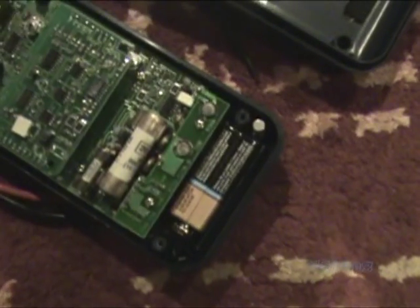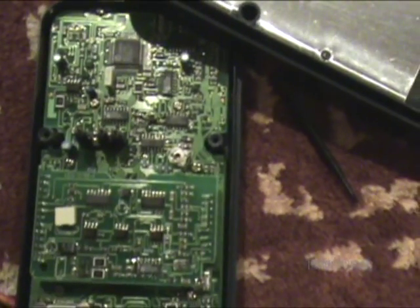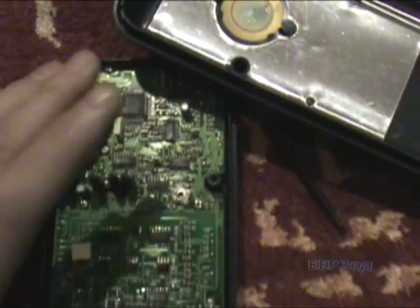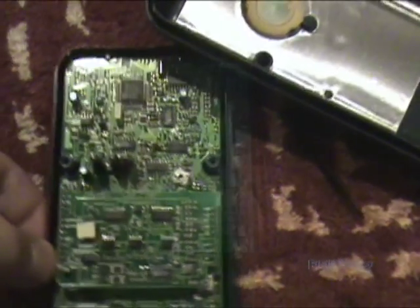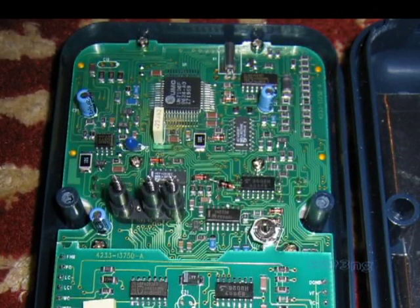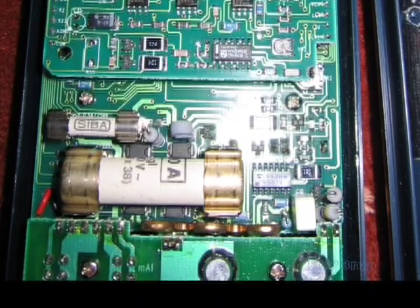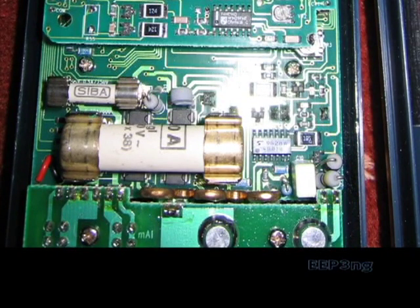You'll see that they've used three springs sticking out of the PC board — that's actually kind of a neat idea. It probably saves them labor time, always having to solder wire on. At the very top there you also see the processor used for the device and the soldering is quite neat. There's a daughter card stuck on the main board and at the very bottom you see the two fuses, and the 10 amp current shunt is that brown looking wire there.